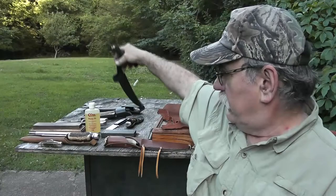I'm going to show you how I use the diamond stick on this fillet knife — I just filleted some fish the other day and it's a little dull. You just want to maintain the same angle on each stroke, and try to use the same number of strokes on each side. Don't give one side 30 strokes and the other side five — keep it about the same. You get a good keen edge in a hurry because the diamond stick does a great job putting a nice micro finish on the edge of any blade.